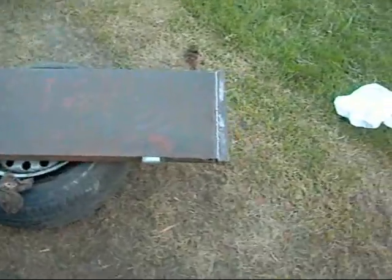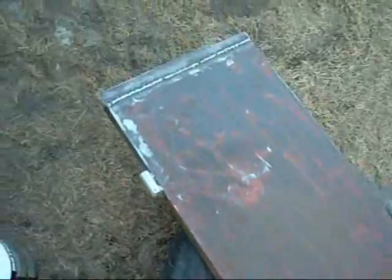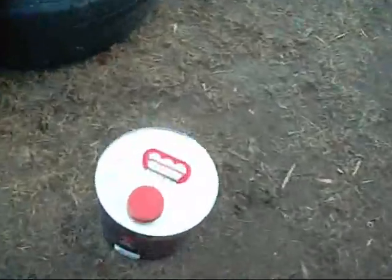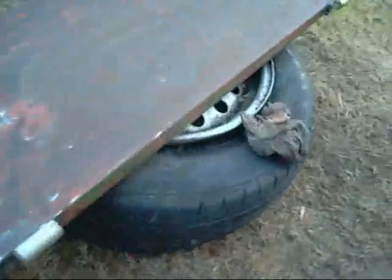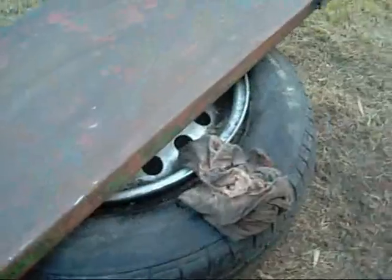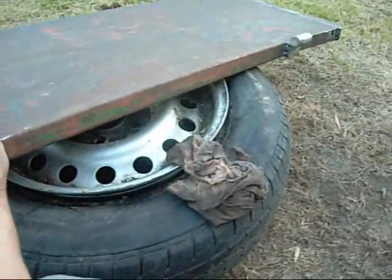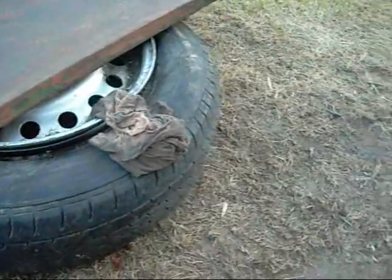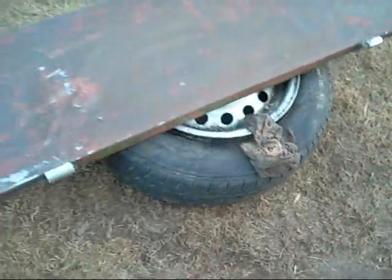Well, the tailgate came up alright — a heap of flap wheel work to get the scale and crap off. The welds are alright; you don't want to take too much material off or you compromise your weld strength. Lots of acetone, already washed it down — good stuff. Don't use a tire that you care about because this stuff does eat tires, and so does the paint. It's only an old dunno wheel. I actually had a couple of yobbos asking about old tires the other day — I told them I'd rather run a box cutter through the sidewall and throw them than sell them. There are too many yobbos around here doing burnouts on unroadworthy tires — I'll never give them to them or sell them.